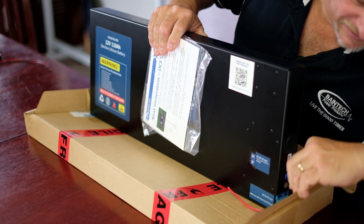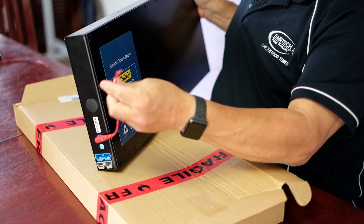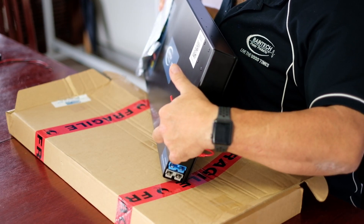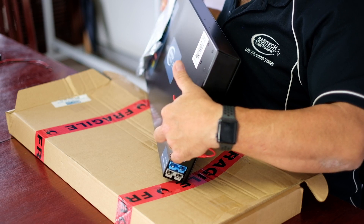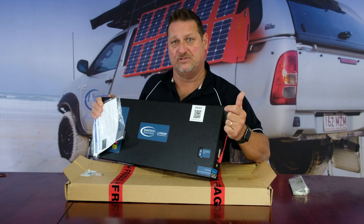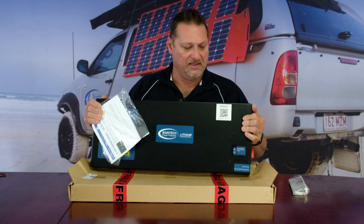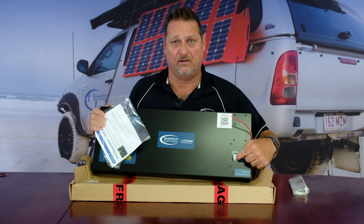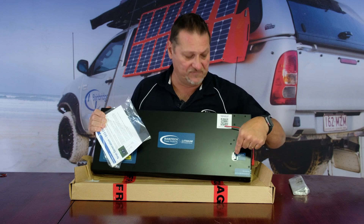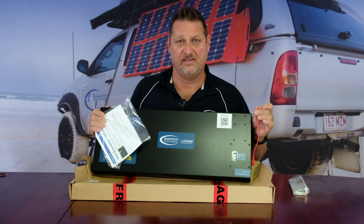In ignition mode, when your car is running the charger is on; when your car is off the charger is off. But it is important that you change the dials correctly. If you put the banana plug — which is what this one is — into the little round port on the end and connect it to 12 volts, that will turn it on and off with the ignition. However, you must also change the bottom dial to position zero and the top dial up from zero to six. That puts it in ignition override mode.